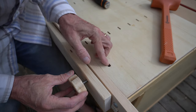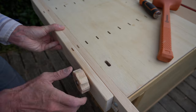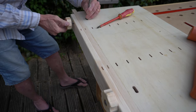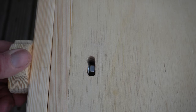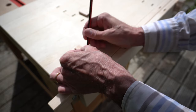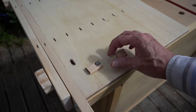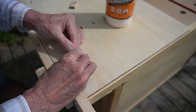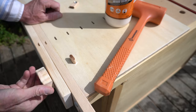The idea was to drop these washers and nuts inside the domino slots and then turn in the threaded bolt — just a little bit tricky to locate the nuts, so I had to prise away with my chisel to align them. I had a little bit of an issue not being able to tighten the vise up fully because the nuts were spinning on the edge of the bolts. I initially wanted to fill this with two-part epoxy but knew the threads wouldn't work then. So I came up with the idea of tightly cutting the domino around the nut to stop it spinning — marked them out, cut them out on the bandsaw, applied some glue and drove the dominoes to sit tightly around the nut. And this actually works.